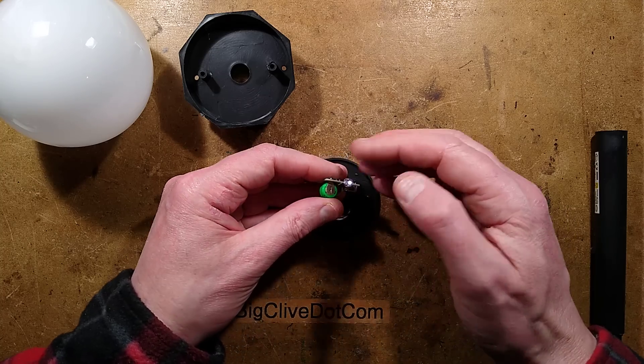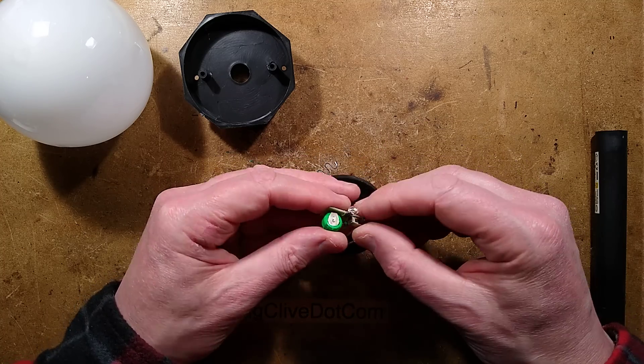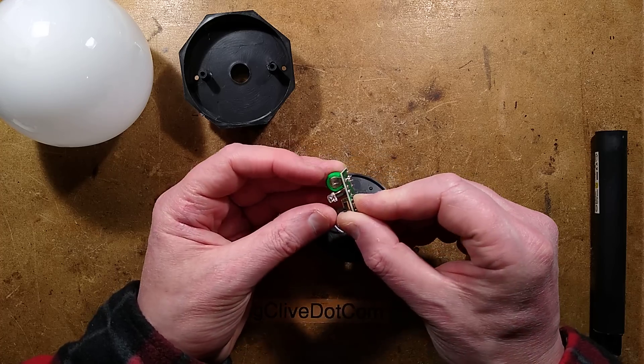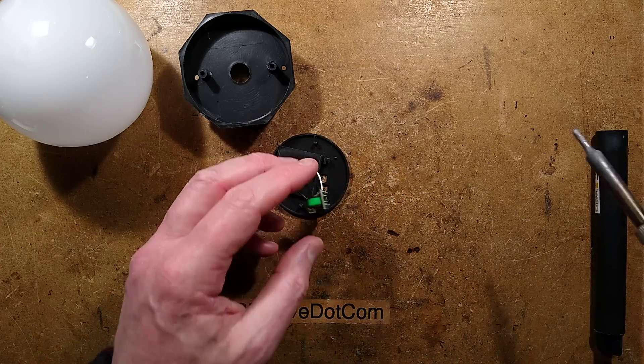You can upgrade the cell if you want. Let's take a look at this. Let's turn it off — it's cold white at the moment, that's not great. Let's take that LED out, noting that the negative connection to the battery is the negative connection of the LED. I am going to flow some solder onto that. I'll zoom down for this.